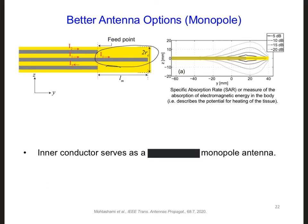The right side of this slide shows some simulation results for heating caused by this antenna. Do you think this antenna is working well for this application? Looking at the results on the right, we do see heating around the antenna, but we also see the heating extending up the transmission line — quite a bit of heating up the length of the transmission line. This is caused by currents generated on the outside of the outer conductor, which is not ideal because it expands the heating zone and makes it harder to only heat up the tumor and none of the surrounding healthy tissue.